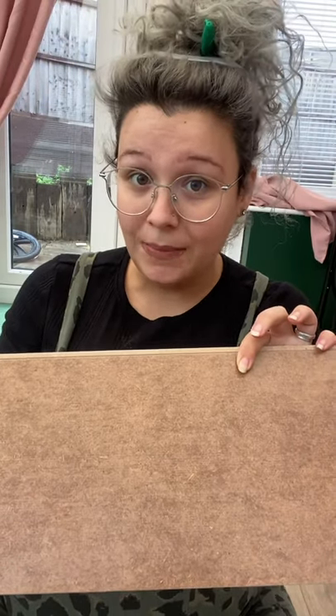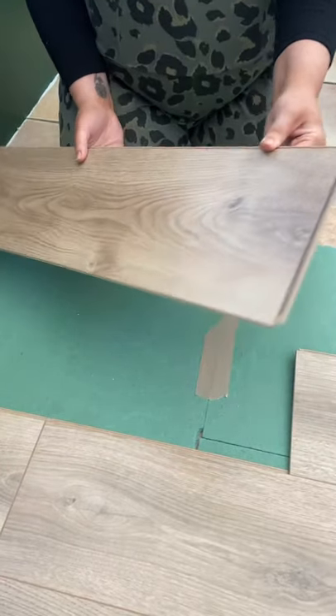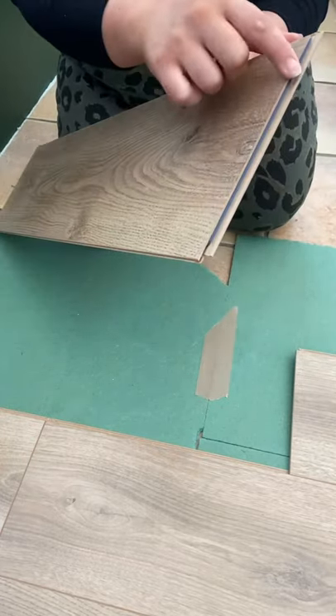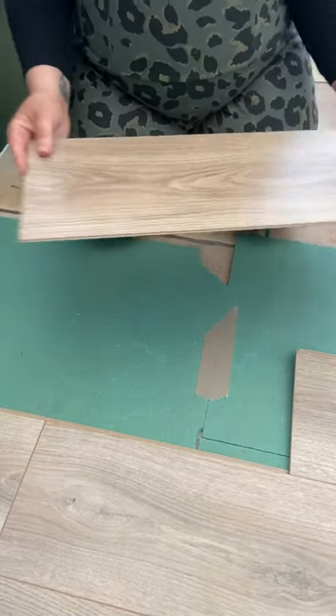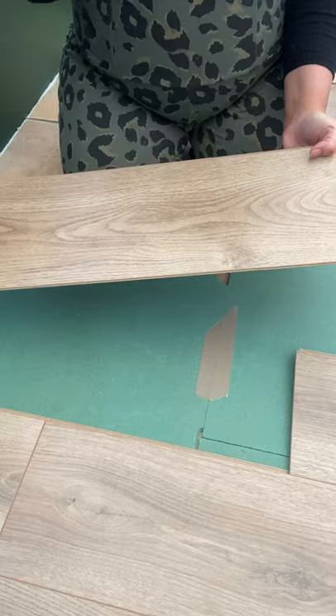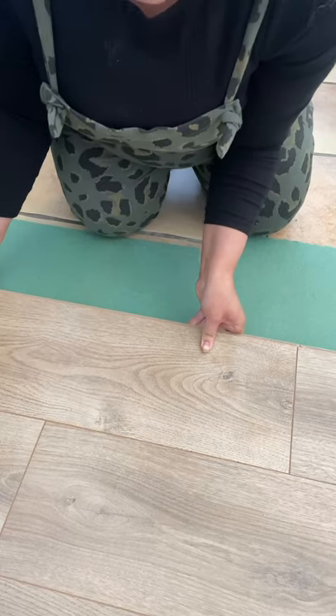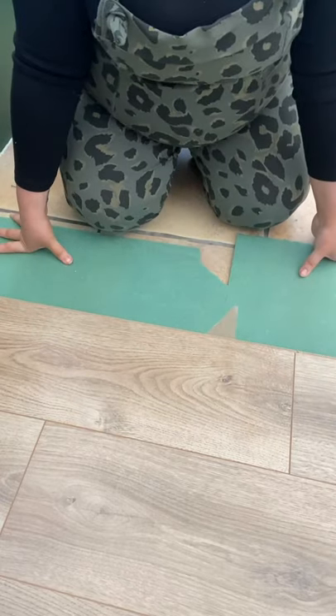You can do this with a table saw, a hand saw, or a jigsaw. I have a table saw as it is much easier. Do not lean over it, do not stand in front of it, watch your fingers, and make sure you wear something covering your eyes as it gets a little dusty. This is my piece cut to 71 and a half centimeters — the half centimeter allows for this lip to go underneath the laminate and still give the expansion space at the side. Listen for the clicks and it's all fitted.